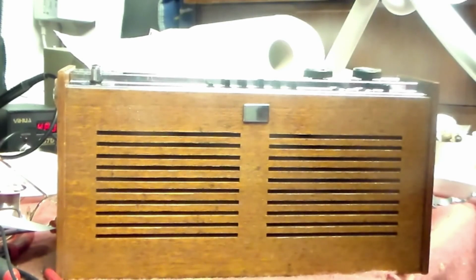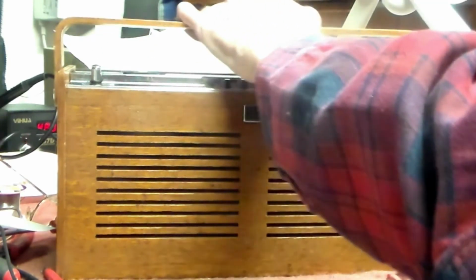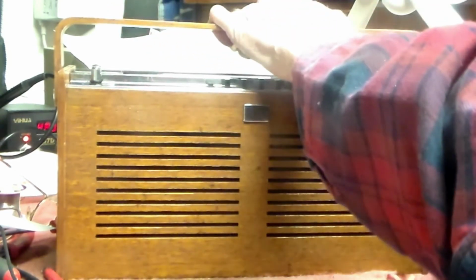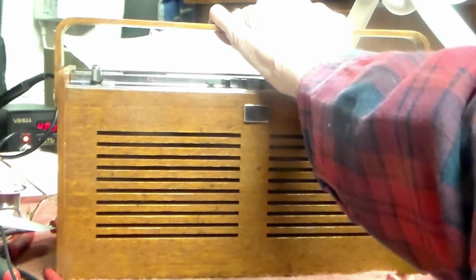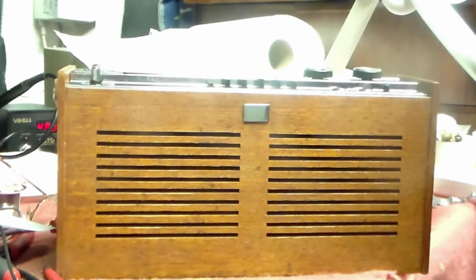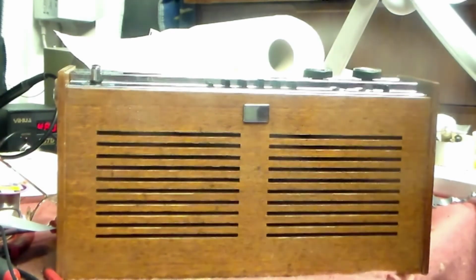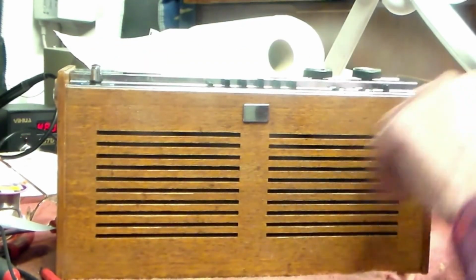Also, by the way, this is now converted from a PP9 to a PP3. I won't be using it that often, and a PP3 now, after technically having been improved, is nearly as good as the PP9 was then. So I do tend to convert them and I'll have a separate lid if I want to put a PP9 in it. But for now, this radio is finished. It's going to be put into use for now, but obviously it's going to be taken apart again and I'll have the AM sorted as soon as possible.